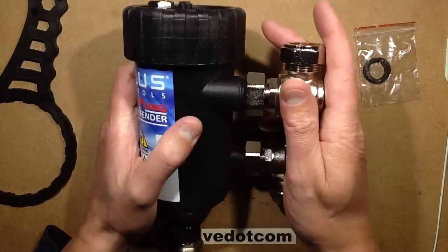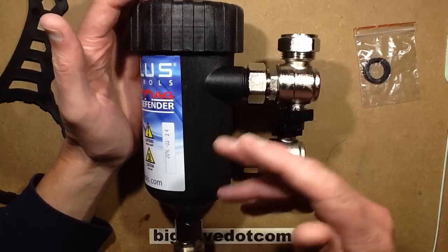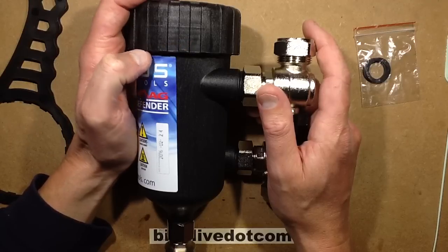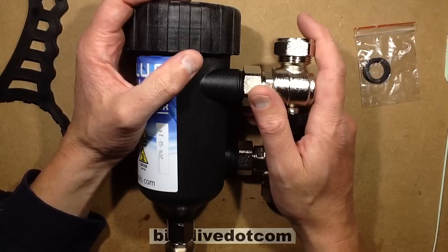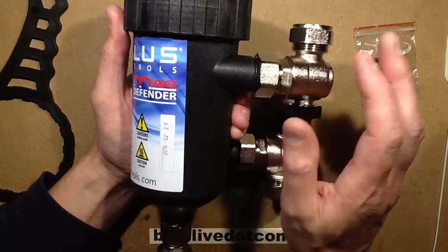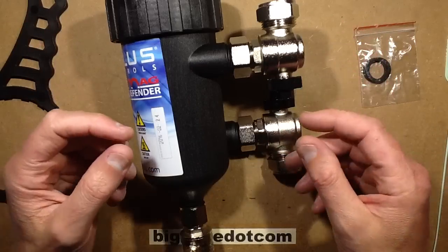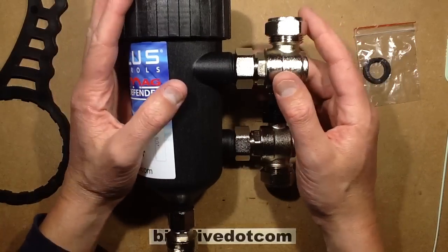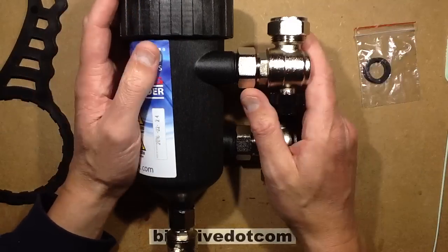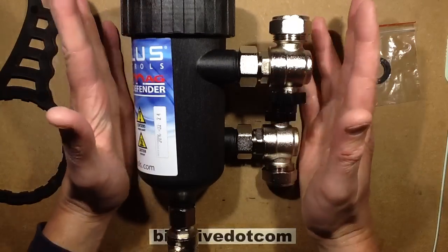The water flowing through your heating system gets contaminated with a magnetically influenceable sludge — basically rust off your radiators. The water flows around steel radiators; they may be lovely and white with enamel on the outside, but they're pretty much steel on the inside. They corrode over time, and after a while the corrosion reaches the outside, giving you pinholes and little drips of water. You can get corrosion inhibitors that work by forming a protective coating on the metal. With copper pipework and steel radiators together, you'll get a reaction, and contaminants in the water will cause rusting. This device is designed to help keep your system from sludging up excessively and also lets you add corrosion inhibitor.